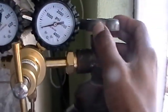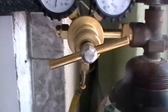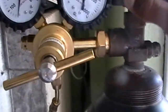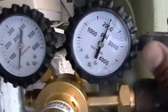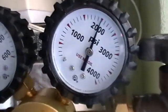Before you open your head valve, just make sure the adjustment handle is slack — loose, not in the open position. I'm going to open this now. If you look closely you can see about 2,000 pounds per square inch of pressure, which means my nitrogen bottle is full.